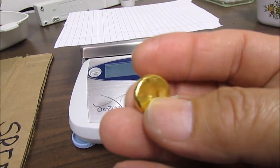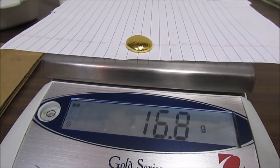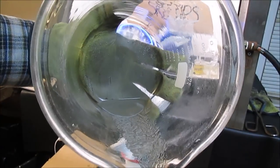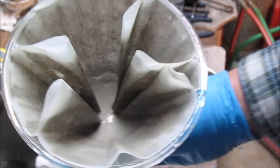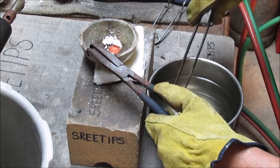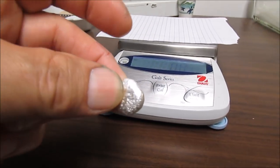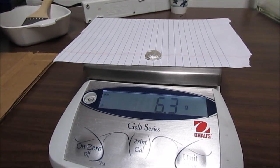Here's the button that I just melted. I put it on the scale and get a final weight — 16.8 grams of pure gold. Only one thing left to do: get the silver into a filter paper. This is what the silver looks like — it's gray in color, looks like wet cement. That's why they call it cement silver. I put it in a melt dish and start melting it. Here's our button of silver — it's about 99% pure and we got 6.3 grams.